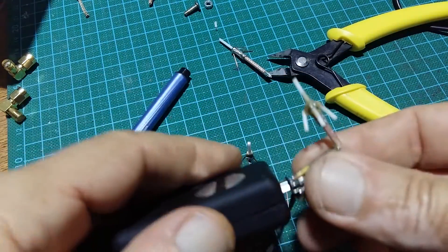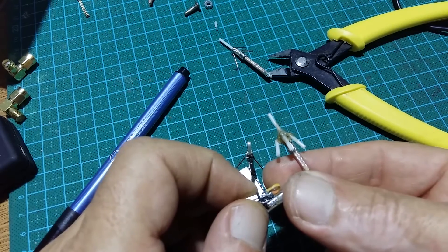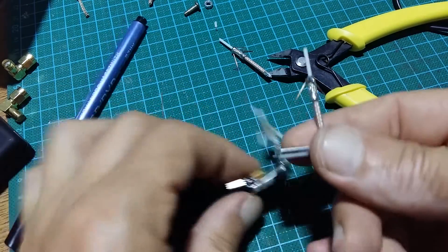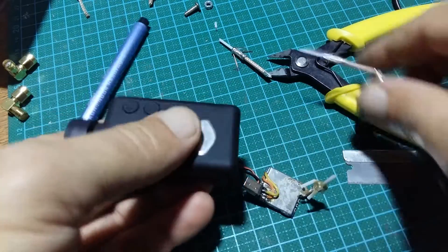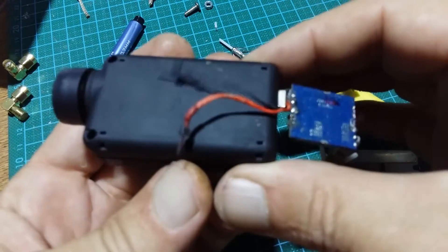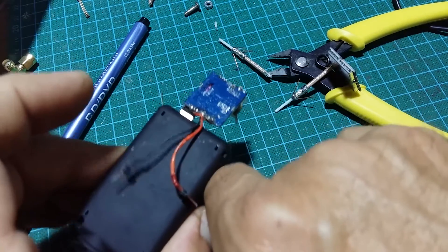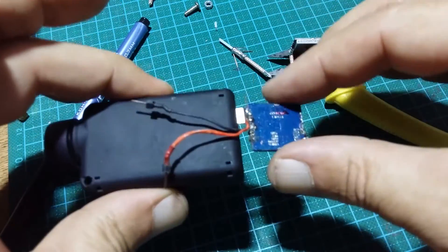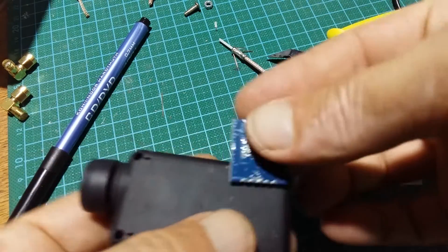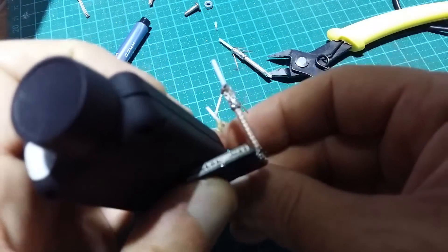I tested this one and got video signal on 3 kilometers but it is not recognizable - it is pretty bad. Now I will test this new antenna. I should make another change: the idea is to put it here so it is upside down. There is a problem - it touches the ground. I have legs which are not sufficiently long. Instead of this connection it is better to put it somewhere here.